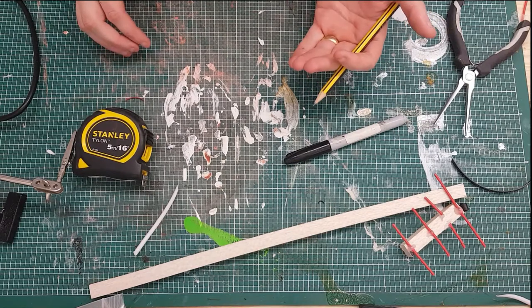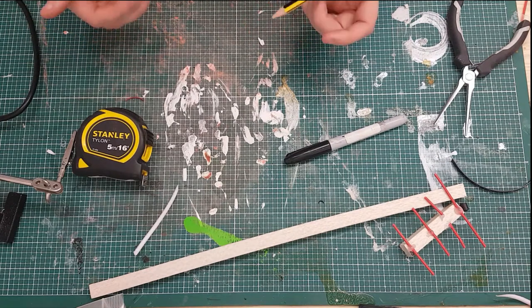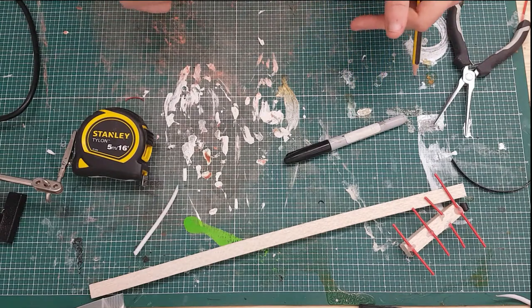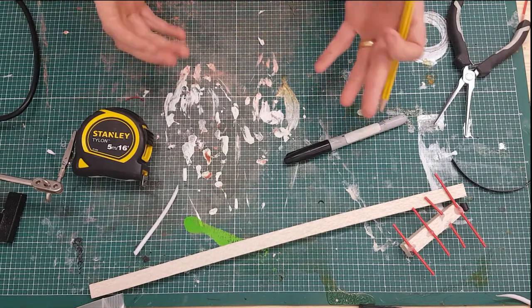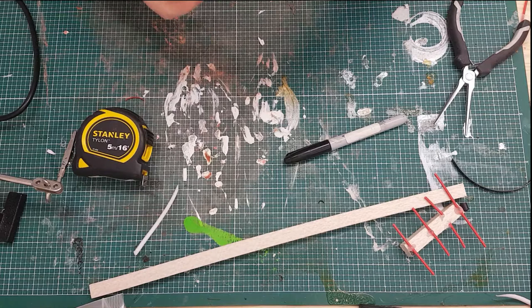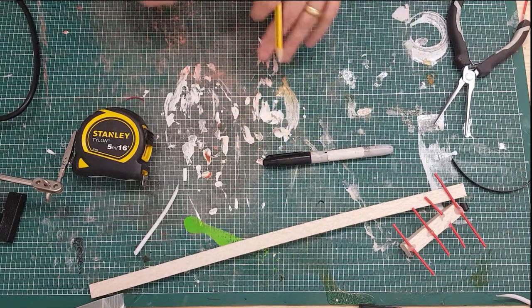Also, I measured the resistance of the antenna and the copper radials, just to see what the difference between the metals was. But I realised this might be a bit confusing. The resistance of the antenna doesn't matter massively. It does a bit, but the way that the RF actually travels through an antenna whenever it's radiating, it doesn't travel the same way that electricity would through the copper wire. So the resistance isn't as vital. I was just using that as a way to see what the different properties were of the metals.